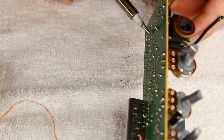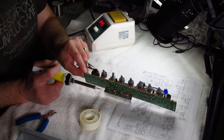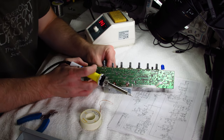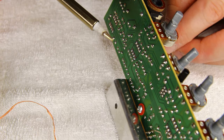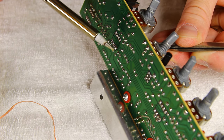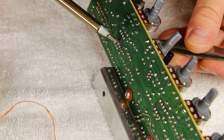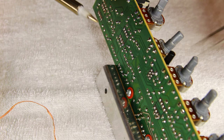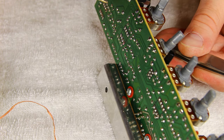The secret here is to not apply too much heat to the trace because, like I said, if you overheat it, it's likely to cause the adhesive to break down. Then we'll go to the other IC area which is here. This is actually easier to do by yourself without a camera. It's almost easier just to push the pins out a little bit with the soldering iron and then grab them with the tweezers after. Okay, one side is done.